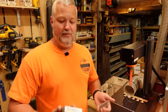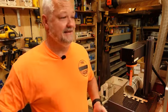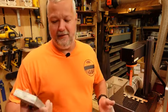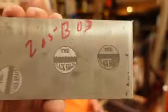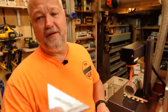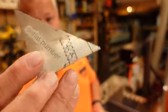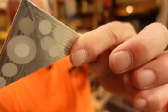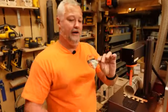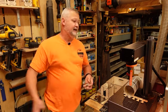I've been testing extensively and I've come to the conclusion that if I want to do it because it's cool I'll do it, but for doing it on any major level for a customer it's going to have to be a lot of pieces to make all the R&D worthwhile. Aluminum is one of those materials I think I could see myself using more so than trying to get colors on stainless. Marking stainless — putting numbers on stainless — is quick and easy, the settings are pretty forgiving. But with aluminum you can actually get some pretty cool colors, and this scrap piece of aluminum from a CNC job is what I used to see what colors I could make.